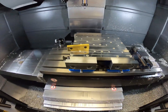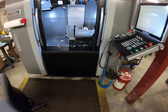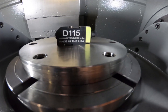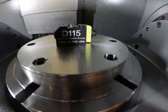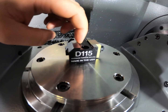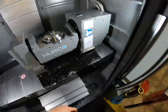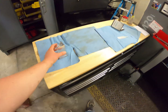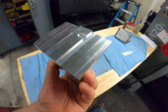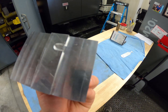Today I want to talk a little bit about workholding, and specifically workholding on a 5-axis machine. We got these little vices made by 5th Axis — actually they're called dovetail fixtures. If you have a pre-machined dovetail in your slot, you put the dovetail on here and it tightens against it, sucking the part down onto these ground faces. Here's our part after it was machined — you can see we put this little sacrificial base on it with a dovetail angle and a little slot to locate on the pin.